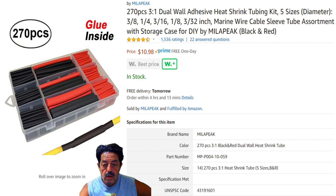Would I use this on house remodeling, like ceiling fan wiring? Probably not — I doubt it really complies with code, and you could get into a code violation. I've never used it on interior house wiring or remodeling. It's really for boats, trailers, and different kinds of connections that are not inside a house. They're meant for DC applications like automotive — not AC applications like home wiring with 12-2 and all of that.